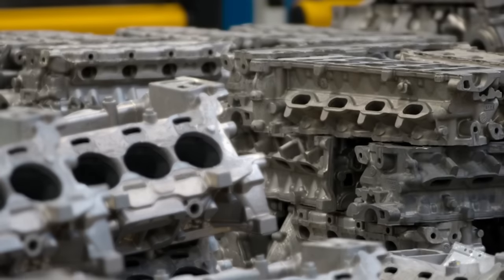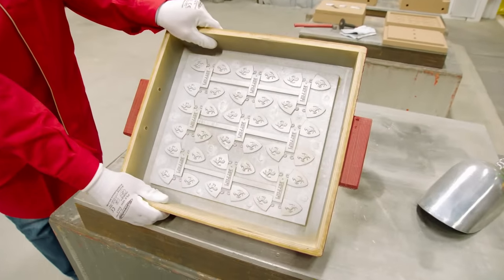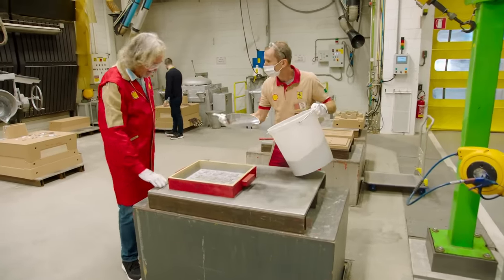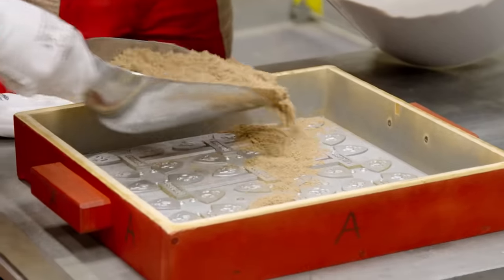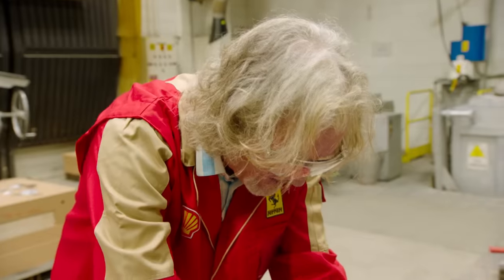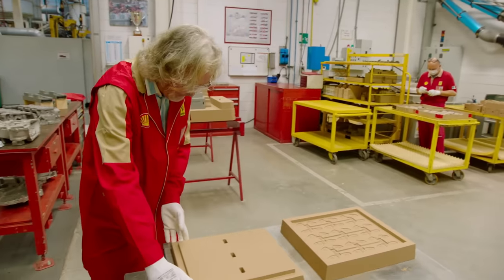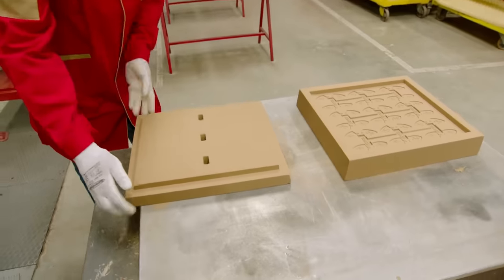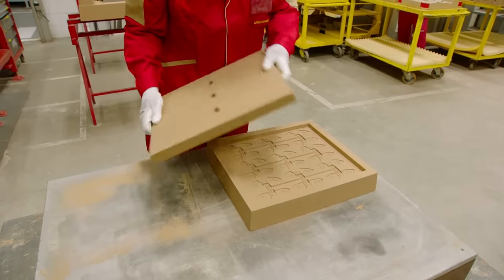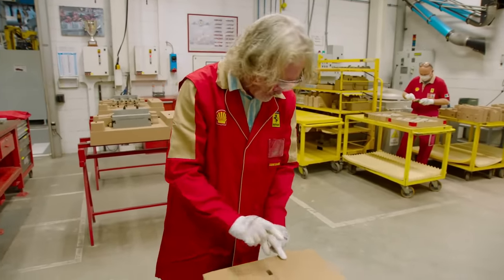Here are some the professionals made earlier. I'm going to move on to another key job. A tree of Ferrari keyrings. Sand is here. We've got 4 minutes. Buongiorno. Now we've got about 2.5 minutes left before it goes completely hard. And 2.5 minutes later, the other half of the mould is a simple lid, which has in it the runners and risers. That's where the aluminium goes in and then comes back out again. If we assemble that, we are then ready to pour.